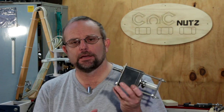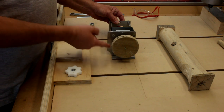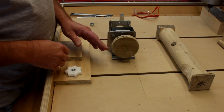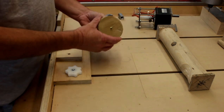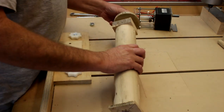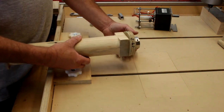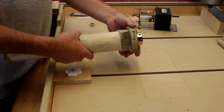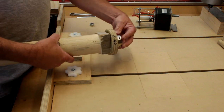Having had a bit of a play with it, I found a few issues. First was the backlash, which is one of the reasons I originally abandoned this design, and the second one was how I attach the stock to this plate here. Simply screwing it in like so was fine when the motor was turning in this direction, but as soon as it started turning the other way there was the potential for it to start unscrewing.